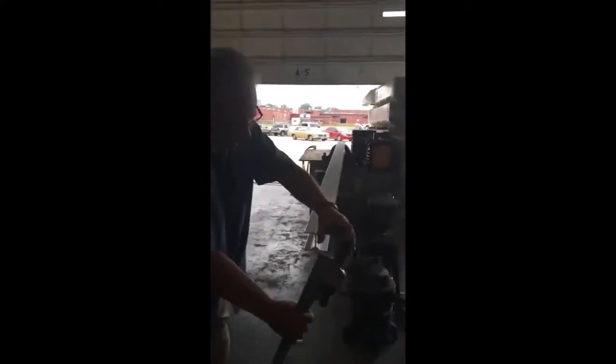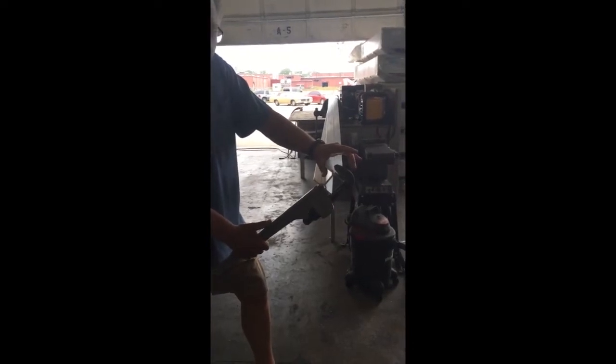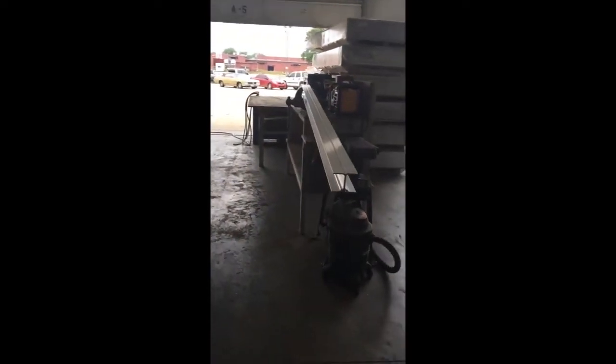Now let's take a look at Barletta's step up from that. This is a piece of the I-beam that Barletta's using. My vise is a little loose back there, so I do get a little bit of wobble, but you can notice that I'm moving that bench — look at that bench move back there. This I-beam isn't moving at all. When I latch this on and go to twist it like I did that C-channel, I get about half the amount of movement out of this I-beam. So the structural integrity of an I-beam is far superior to that of a C-channel.